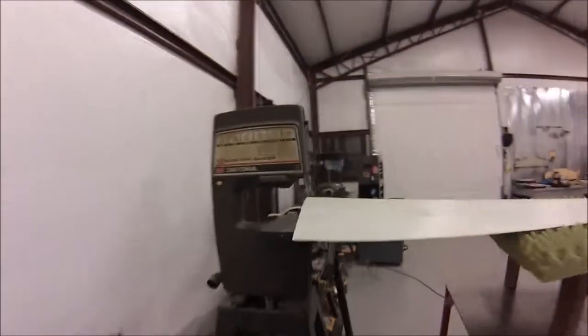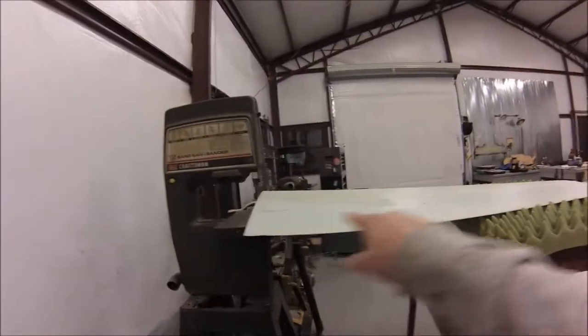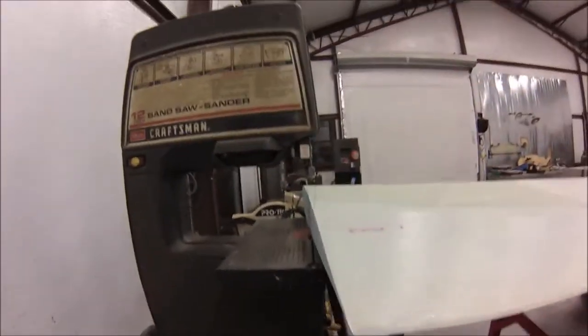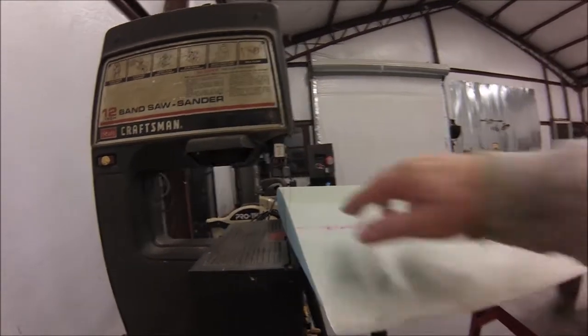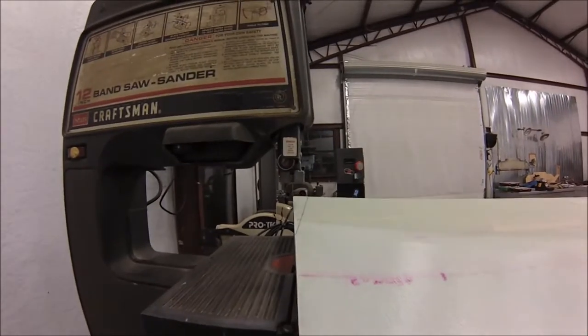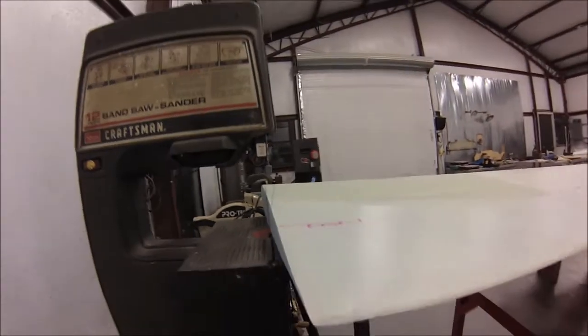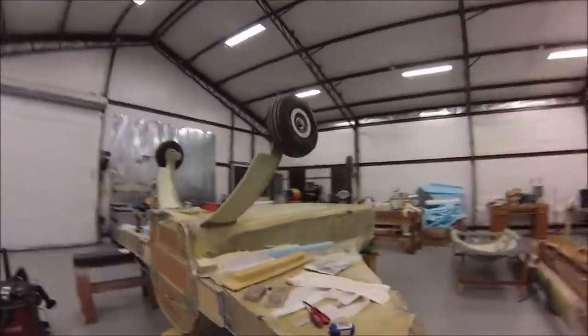I was thinking about how I'm going to cut this. What I've done is set up my bandsaw so that the winglet is level and the bandsaw blade is flush with the side of the winglet right at the winglet root, and I'm just going to cut that out using the bandsaw. That should be nice, precise, and square. Whether it's right or not I don't know, but I think I'm going to be pretty close after talking to the Cozy group.